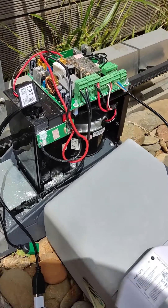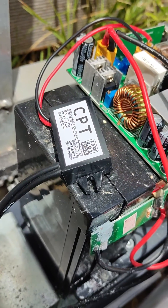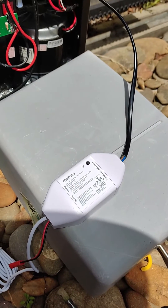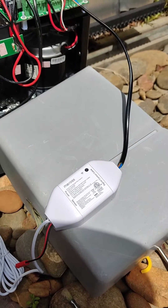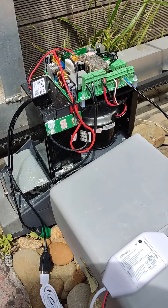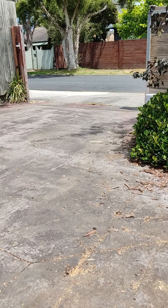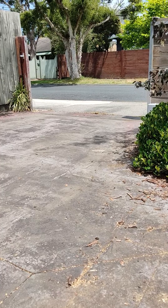I've just managed to get my dodgy soldering job connected into the 12V, which is outputting the 5V for my Meross app to work. All I did was download the Meross app — it was asking for different brands of garage openers, so I just said unknown and it connected. Then it linked me to my Google app and to my Alexa app. Google and Alexa were pretty straightforward to set up, but it's a little tricky in that it doesn't really activate on 'open gate,' only on 'close gate,' because I haven't installed the little switch that comes with the garage door opener.